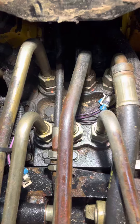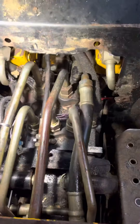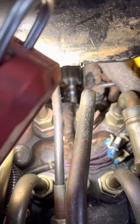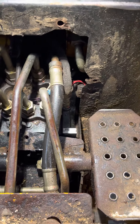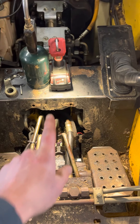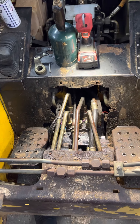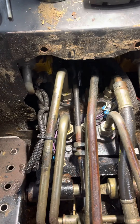I talked to some people and they said to tear out the cylinder in the back — you can see that shiny cylinder that I have pulled out. Don't do that first; I did it and that was the wrong step. They said there was some buildup in the back maybe holding the plunger — the cylinder that goes back and forth — which allows the hydraulic fluid to flow whichever way you want. They said there's some gunk in there, which it probably could be, but that wasn't the case in this one.